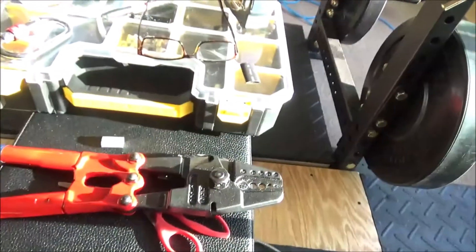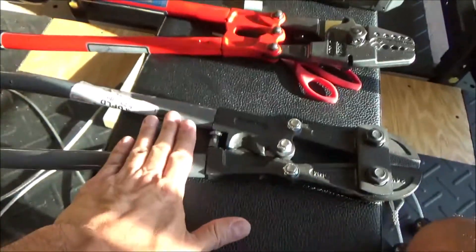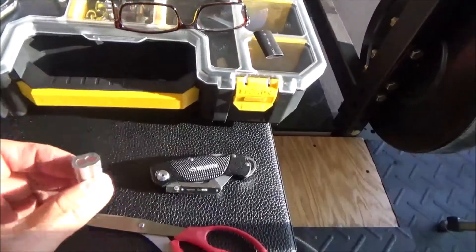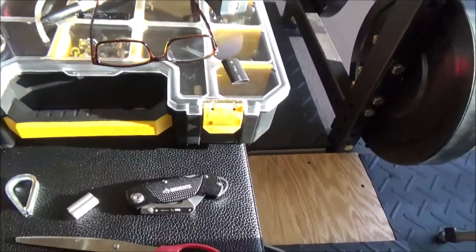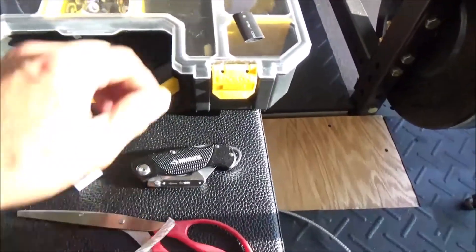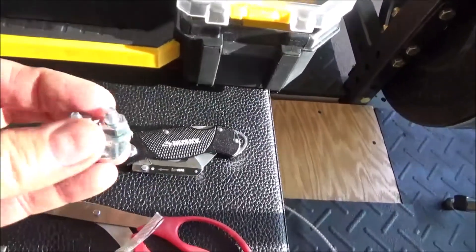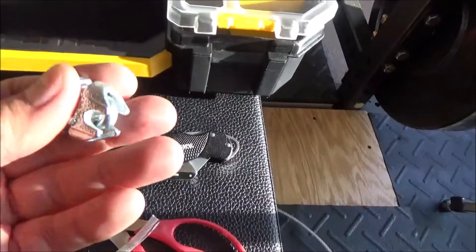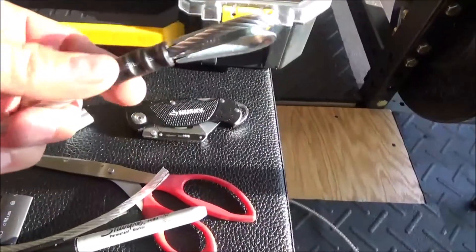So bolt cutters to cut the cable, or you can use the cable cutters here — but you have to strip the wire to let it fit — and then a swaging tool. Those are the two big tools you'll need. What we're going to do is put the cable through here twice, then smush it down, and that'll hold the cable securely. Swaging actually mushes the aluminum into the little recesses in the strands of the cable. I've swaged this end and then put some shrink wrap on it so it has a little plastic coating.